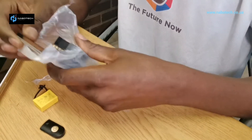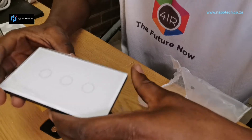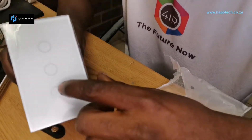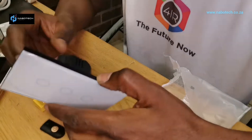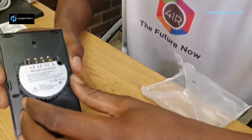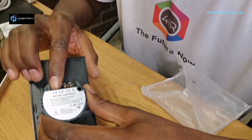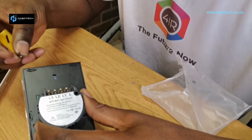There is a capacitor included. The switch is beautiful — it comes in white and black, with a gloss finish. This one is a 3-gang. For connections, you have the live input and then L1, L2, and L3 which are the loads or returns.